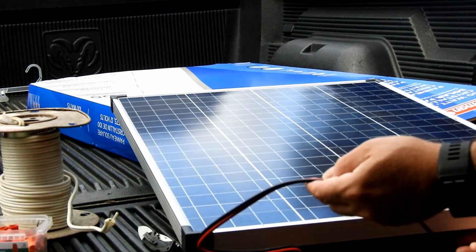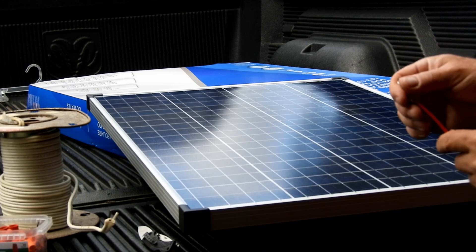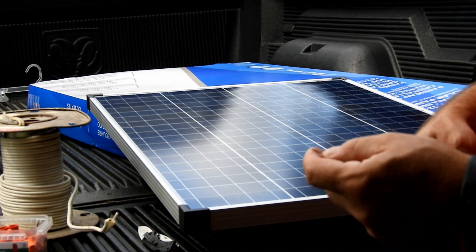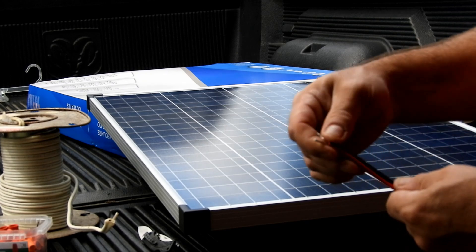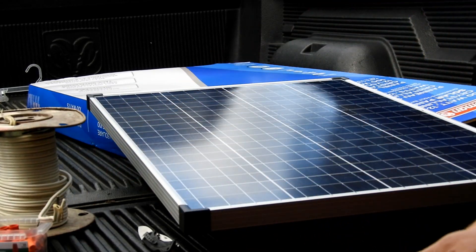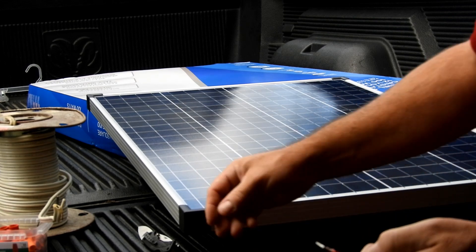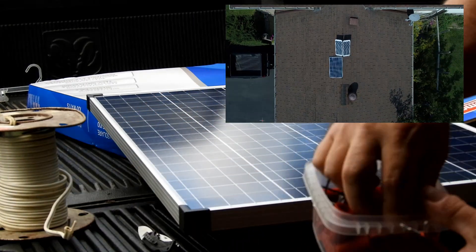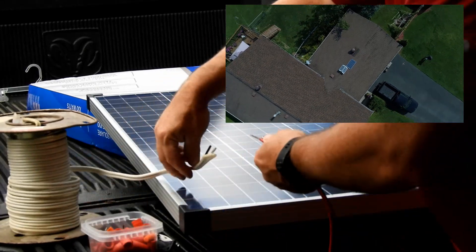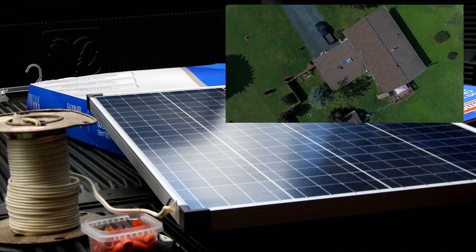It comes with 8 feet of wire. I'm not sure what gauge this is, but in this case I'm just going to use some household wire to make up for any length that I need — I won't need too much more in length, maybe another 8 feet. This wire is just some stuff I had laying around; it's 14 gauge. I was going to solder these on, but I think what I'm going to do is just use some screw-on caps, whichever size fits properly, just to make the connection. That way I could easily remove it from my roof if I want to take it somewhere.